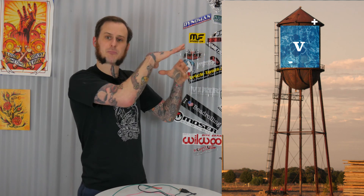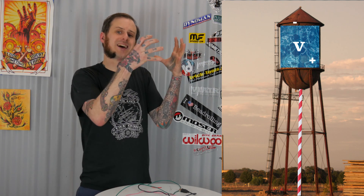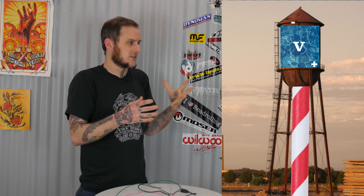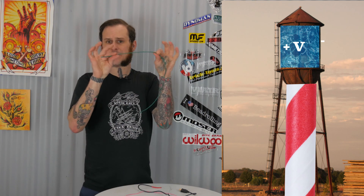Let's break this down into a simpler concept. I'm gonna use a visual here because I find that really helpful. Visualize your battery as a water tower — full of water. That water is your voltage; there's constant pressure, a constant amount of water. That's your battery with your voltage. Now the pipe coming down off of that water tower — that is your wire, the path the voltage will flow through. The larger the diameter of that tube, the easier the water can flow. If it's flowing through a straw, it's gonna take a lot more energy than if it were the full diameter of the water tower. That is the same concept as what's going on with your wire.